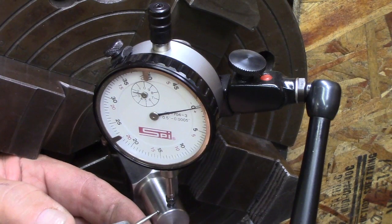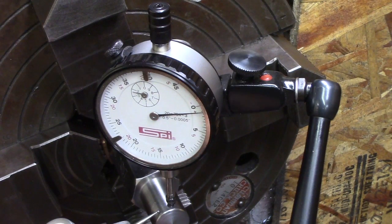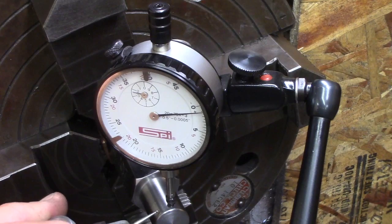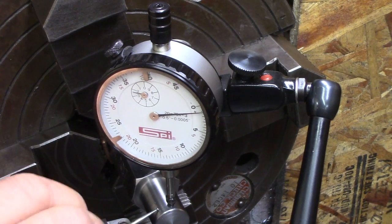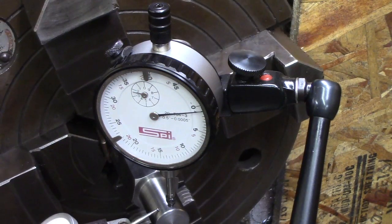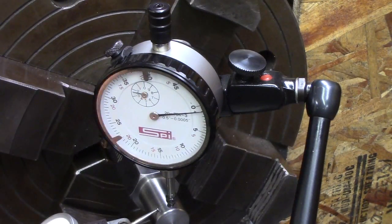So what are you going to test? We should have a deflection because of the way I've machined it. What I'm surprised about, we've got a quadrant and a quadrant. But I haven't pulled it in. If I pull it in to zero plus minus, then we get a different reading. Do you want to try and dial it in more accurately? Then we'll see what the real data is. So what we should have is an average between both ways. Okay, 1 point.